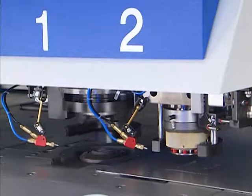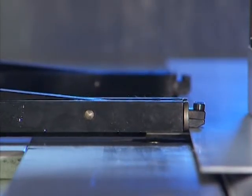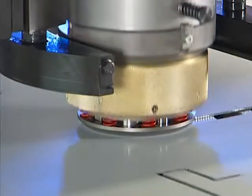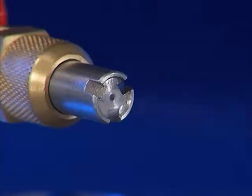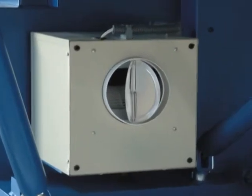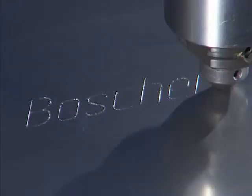We offer numerous options for all CombiCut models. The two standard clamps can be increased to four. The fast hydraulic system allows nibbling with up to 800 strokes per minute and is always equipped with integrated oil cooling. Automatic tool lubrication serves to increase tool life, especially when nibbling stainless steel, and avoids edge burrs in aluminium. The suction system for scrap avoids scrap being pulled up. A marking tool is available for all models, allowing the marking of sheets with 10 different fonts.